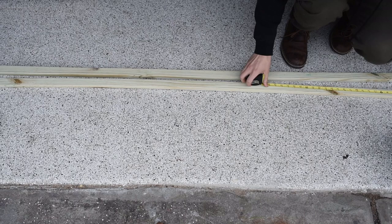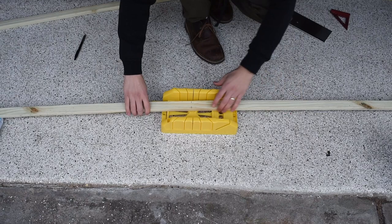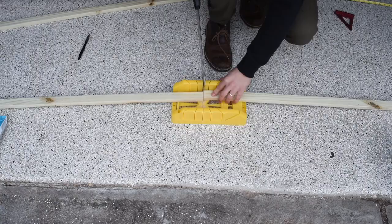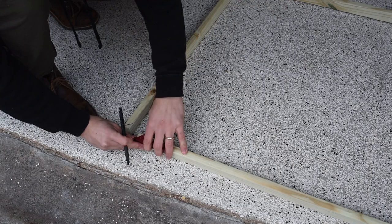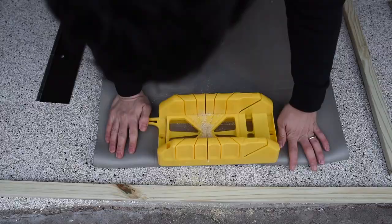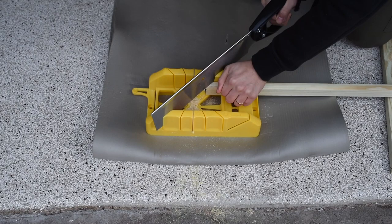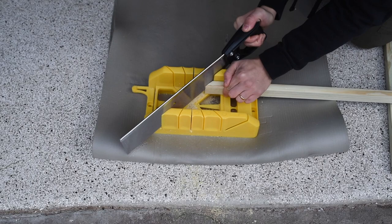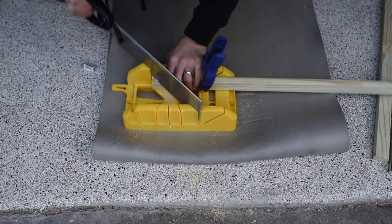So step one is to measure out your pieces. You're going to need two pieces of the same size for the height and two pieces of the same size for the width. Once you have your lines drawn, you're just going to cut straight using the 90 degree angle cut on your saw, and you're going to do this for all four pieces so that you have two pairs of two matching sizes. Once you have those, I turned them on their side and made a 45 degree angled line. You can do this with any standard ruler and eyeball it, or if you have one you can use a triangle or slanted ruler to make a more accurate line. The next step is to make your 45 degree angle cut using the guide that comes with your saw. For this part be very careful — there are moments where your hands can be very close to the saw, so just take your time, go slow, and if you have protective equipment definitely use it. I found that a clamp was very helpful in holding everything together so that things didn't move a lot while you were making your cut.